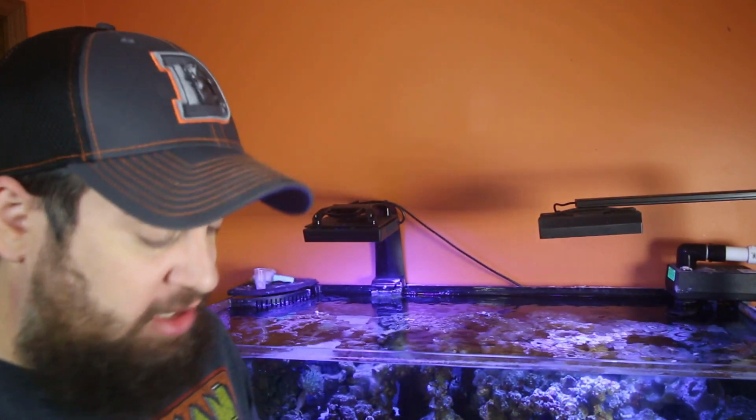So I've got the unit calibrated. I've entered it into the sump where my probe holder is. For calibration, like I mentioned, it's just real easy. You put it in the 7 solution, adjust the dial, put it in the 10 solution, adjust the dial, put it back in the 7 solution, see if it needs adjustment. If it does, adjust it again, put it back in the 10, see if that needs it. You basically go back and forth until you don't have to adjust it anymore. And that's all you really need to do. So it's actually a very simple setup. You just have to be a little bit tedious to make sure that you're not having to continually adjust it. Once that goes, you're good to go.